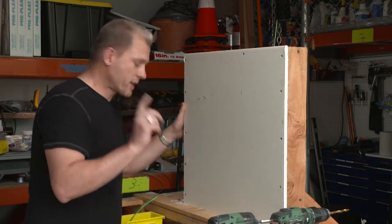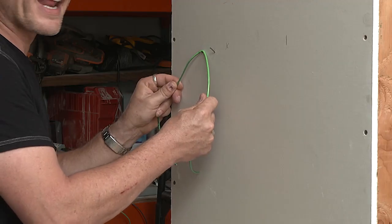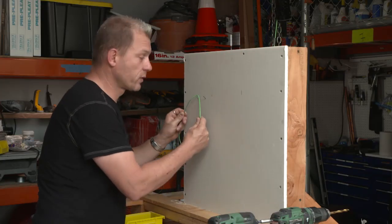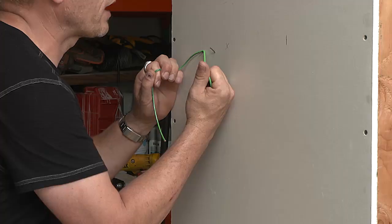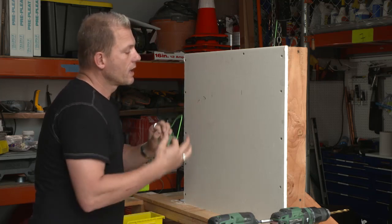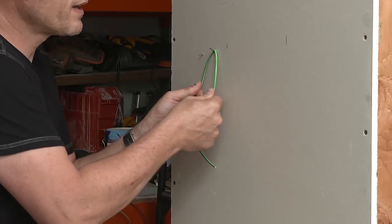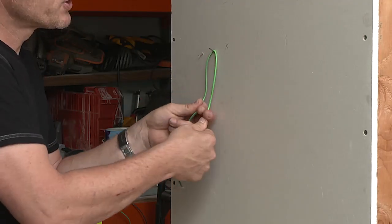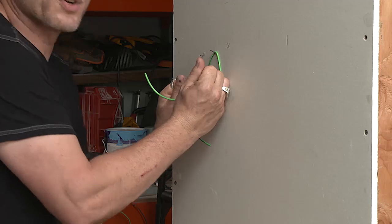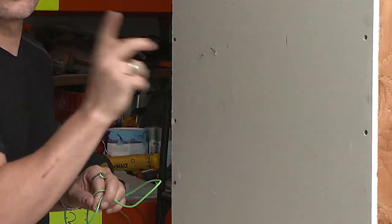There's a big difference, and here's why. Let's pretend this is the wire on the back of a picture. If you have a flat nail, two things are going to happen: the wire could slide off and your picture goes crashing to the floor, and if you put some downward forward force on it, it doesn't take much to start ripping the drywall. But if you hang it at a 45 degree angle, science comes into play — it can't slide off, and because of the angle and the downward force, it's much stronger and doesn't move down. So for a light picture, put your nails in at a 45 degree angle and they'll hold nice and tight.